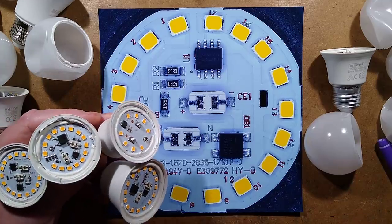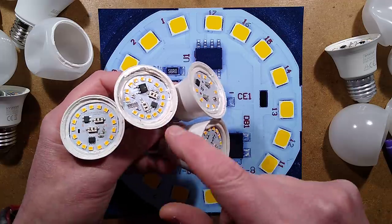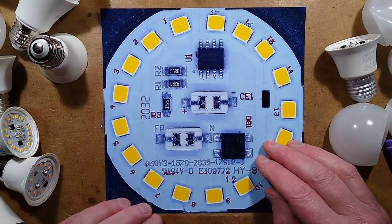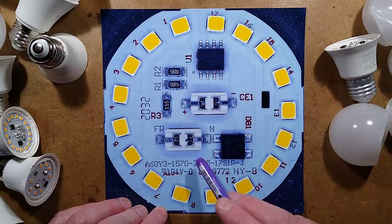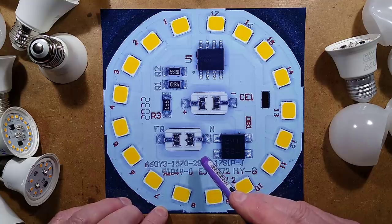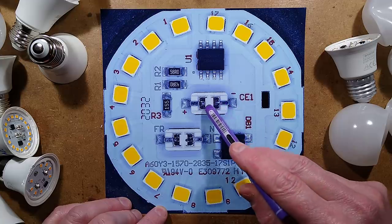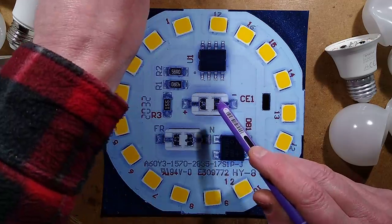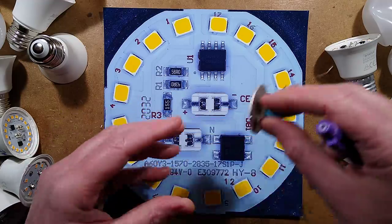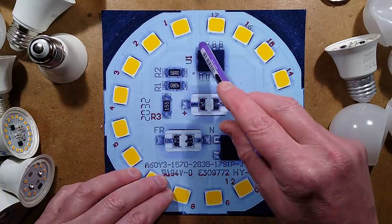There may have been lampmageddon while the camera was off, but some reverse engineering has been done and experimentation is about to be done. These are all using push-in connectors for reliability from the electrolytic capacitor's perspective. The supply comes in and goes to the bridge rectifier, actually going via a resistor on the back of the board - in this case a 30 ohm resistor, which is quite high. It goes to the bridge rectifier and then to a capacitor just stuffed into those terminals off the board, to keep it from getting too hot.